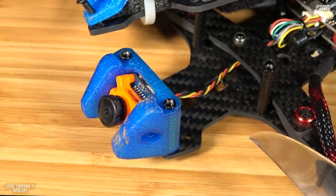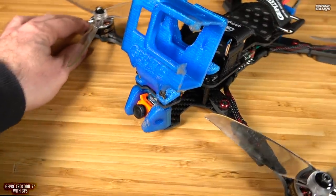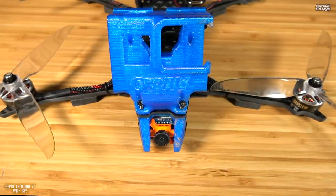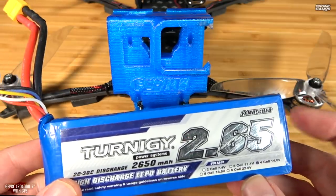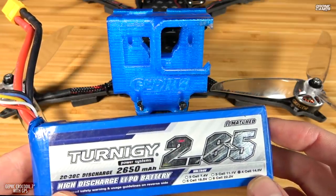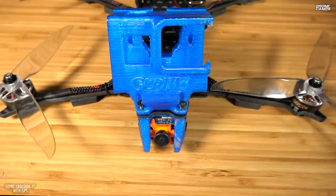Let's talk about flight times and batteries. On Banggood's website they say they were getting around 8 minutes flight time with a 6S 2600 mAh battery. I have the 2650 4S and I was getting 8 to 10 minutes out of that battery, which is great. This is just a Turnigy battery — you can use a low C-rated battery on something that has low kV. We do that on wings a lot because we don't need super high C-rated batteries for racing-level burst. On a 4S 5000, I'm getting close to 18 minutes.